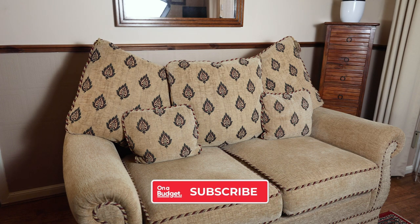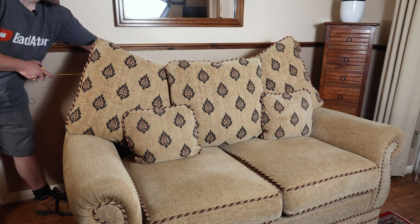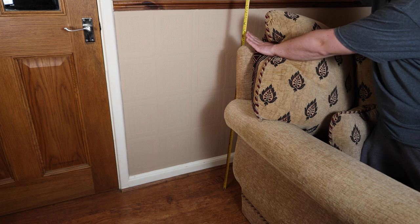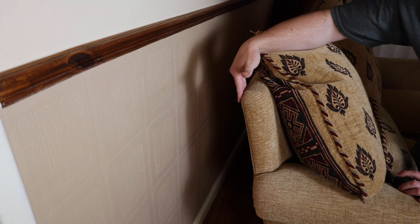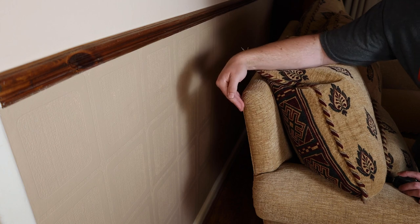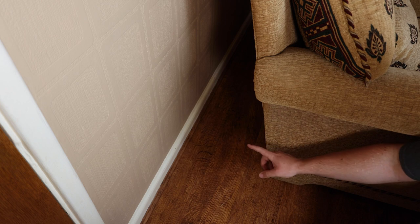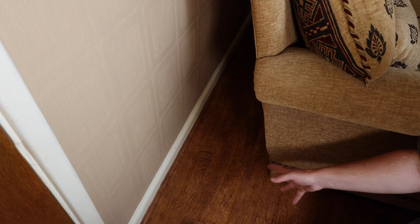Before we start making any cuts we first need to get some measurements. The first one is how long the settee is, so we know just how long the cart can be. We also need a measurement for how high the back of the settee is so we know what height to make the cart. The only other measurement we really need is how far away you have the settee from the wall. I've got this pulled much further away than usual, so I'll get a measurement at the top but also from the bottom. Our settee tapers at the back — yours might be straight down, or it might have a bit of a bulge or curve — so do keep that in mind when getting your measurements.